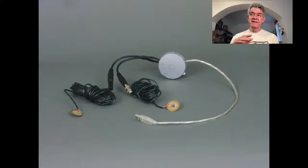So by soldering the wires to both sides of the piezo, running that wire into the microphone, you had a two-channel sensor. And the way that worked was, in Isadora, you would simply use the sound level watcher, the sound input, you'd use this device, and you had two channels where you could tap it, and you could get a trigger based on that. And so that was a way for the students to have a little something that they could touch and trigger things in response to this.